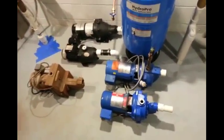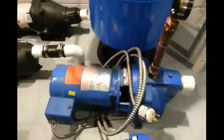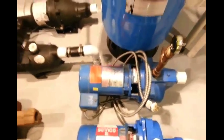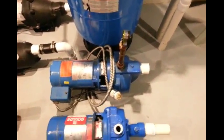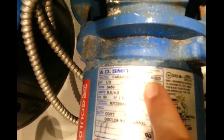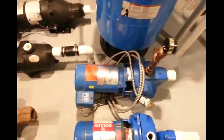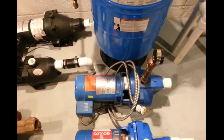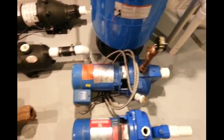When I first got this property it was set up with two pumps. I had this pump, a half horsepower shallow jet pump by Goulds, and it's a 2003 according to the serial number here — J03 on the pump and 8H03 on the motor. So that's the manufacturing year, 2003. It was sitting unused for three years in 2016, so it worked for about ten years and then just sat. And it still worked.